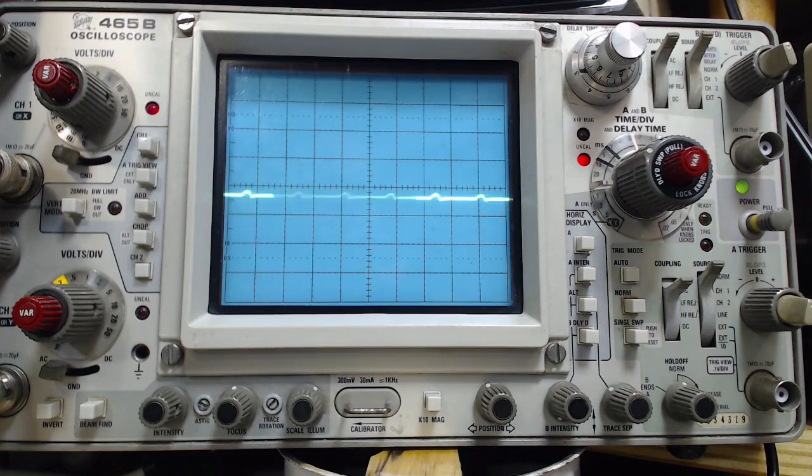So now this guy's got way more capacitance at this point than it calls for on the schematic, because I've added this one in. So the other one conceivably is still 1,000 microfarads. I don't know for sure that this is the problem and it's weak. Doubling it has done next to nothing. I don't think this is where the hum is coming from. Although there is that little hum signal there, that may not be what we're hearing. That may be inaudible. So we've got to find another capacitor to try before settling in on things here.